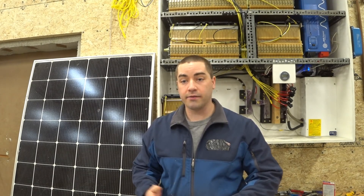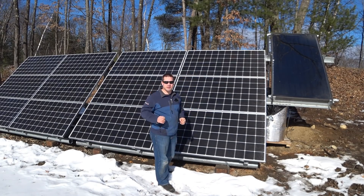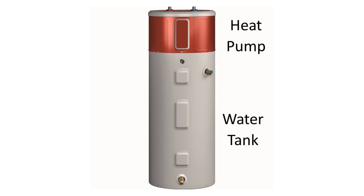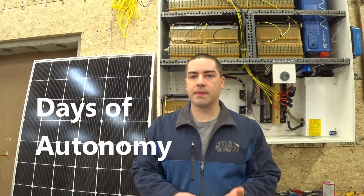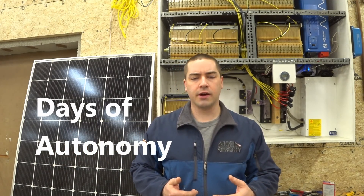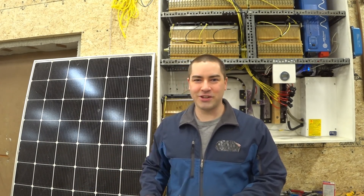In several of my past videos where I've been talking about an ongoing experiment between solar photovoltaic and solar thermal, I've received a lot of comments suggesting I just use a heat pump water heater. A heat pump water heater is kind of like an air conditioner bolted on top of a large tank of water, say 50 or 80 gallons. While this makes a lot of sense for people who are on-grid, I don't think it makes sense for me where I want to go off-grid. You need to think about your days of autonomy — basically how many cloudy days in a row do you expect before you get another sunny day and these panels recharge your batteries.